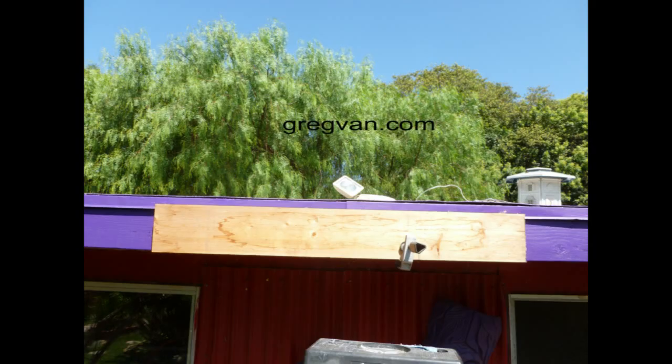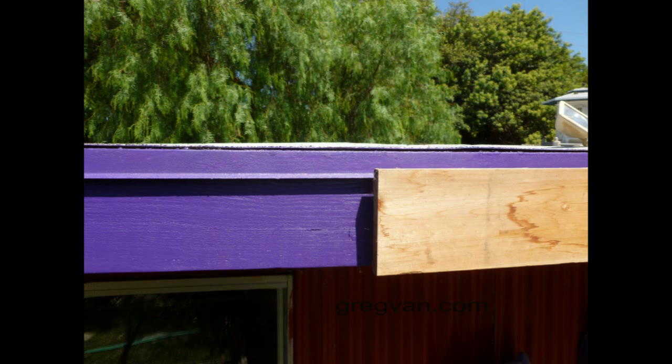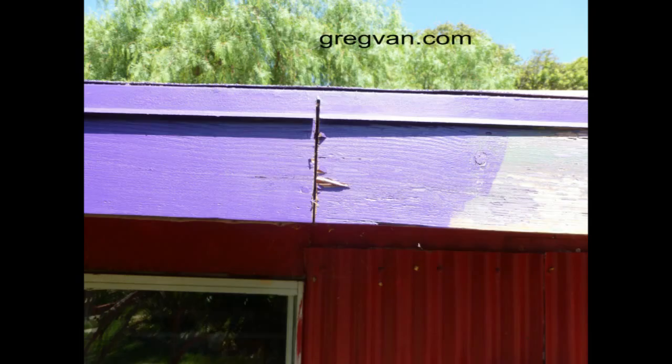Here's the roof — you can see it doesn't have a big slope to it. All I did was grab a 1x6 I had laying around — it's a 1x6 fascia board — clamped it to the existing fascia board, and lined it up with one of the rafters. The piece wasn't long enough, so it's not going to make it on the other side, but you can see here that it's lined up about center, halfway on the board. I just simply ran my saw up the side of each end.